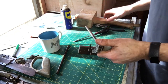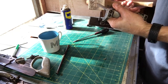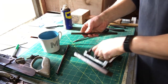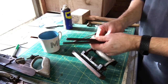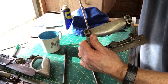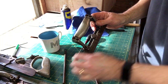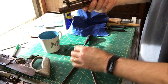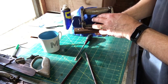The shafts are out. Looking into these holes — these screws act like a cam that clamps against the shafts. There's also another hole below, which I think is to alter the fence height slightly, though I'm not exactly sure. Better go and look that up. The shafts also came with a micro fence adjuster — this screw locates into a thread and that's your micro adjustment for the fence.